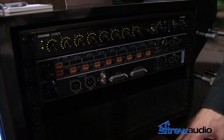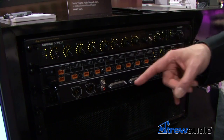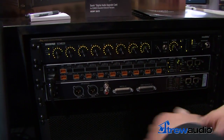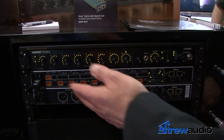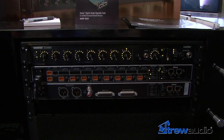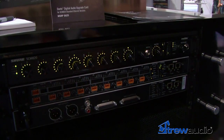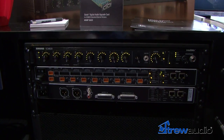In that type of scenario, the SCM820 can just handle the gating or the voice activation of microphones and be integrated and attached to the insert points of a main larger mixing console. But if you want, the 820 can also mix the audio — you've got complete control over which channels are gated or ungated, what the activation points are, and how the channels are mixed together as far as individual outputs and a main output.